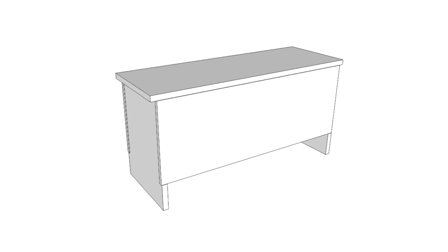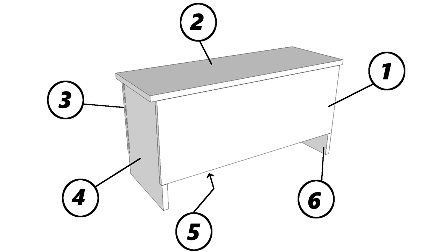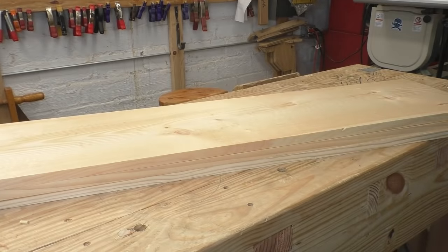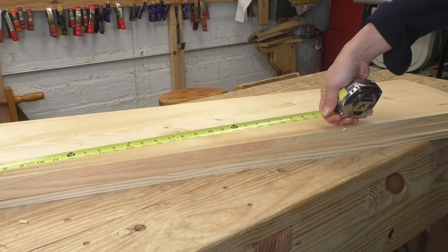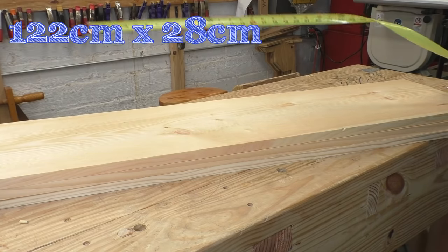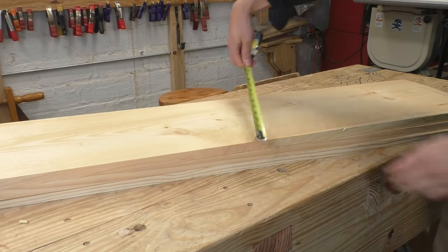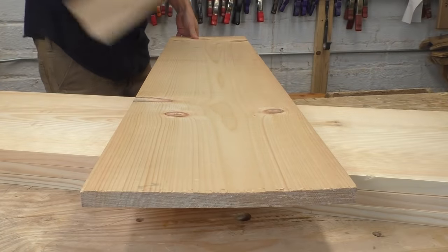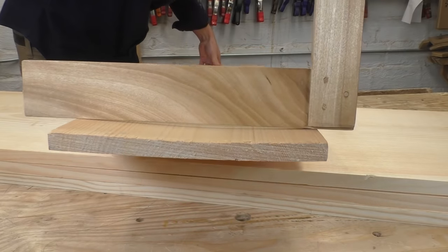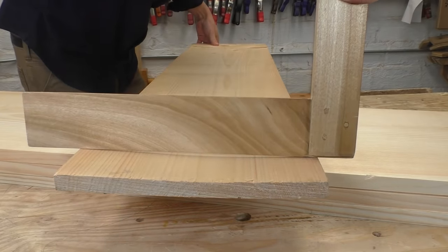This is the basic form. It's called a six board chest for obvious reasons, and this simplicity of construction gives us all kinds of options. But first, we need some wood. These are white pine 1 by 12s from Home Depot. They're 48 inches long and 11 and a quarter inches wide. You can squeeze this project into five of them, but I recommend you buy a little extra — this wood is cheap and some of it might cup badly.